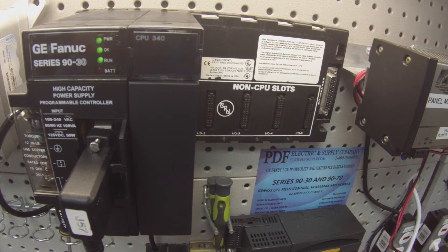So what I would do in that case is go back into Proficy Machine Edition and go to Target, then in the subcategory Diagnostics. In your Info Viewer, the Diagnostics Fault Table will open up and it will show any errors, if there are any, and the reasons why it fell out of run mode. That should help you.